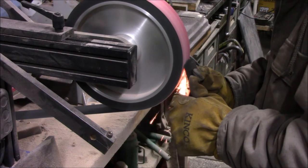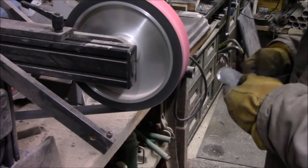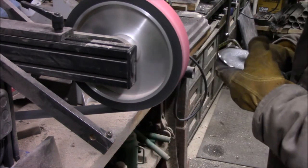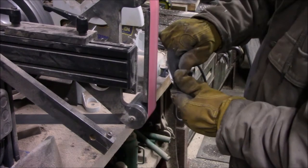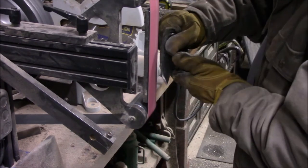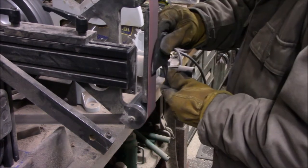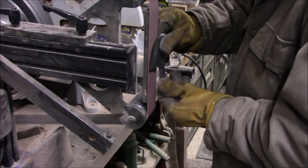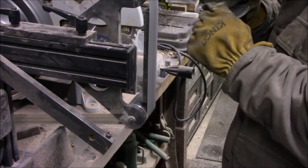I'll have to re-etch it after this, but I knew that from the start. I'm not going to quite bring it to a sharp edge just yet — I'll wait until I actually get into the sharpening to put the final edge on it because I don't want to cut myself while working on all this. I'm just going to finish up the grinds and then go through a couple different belts to smooth it out and get as many scratches out as possible, because I'm going to want that edge to be polished. The smoother the edge is, the easier it will cut through leather.